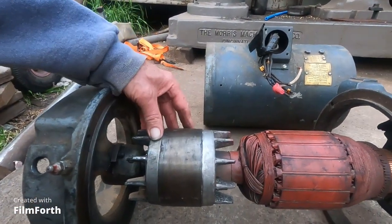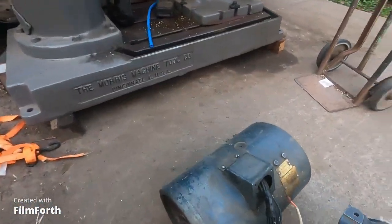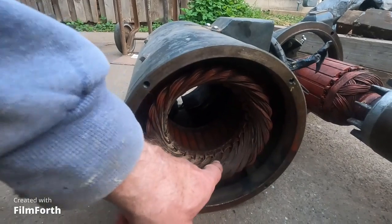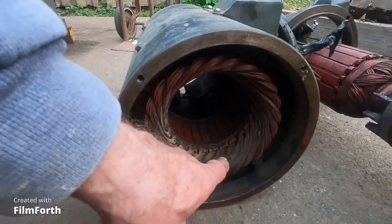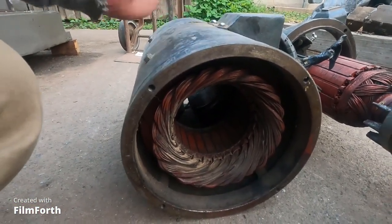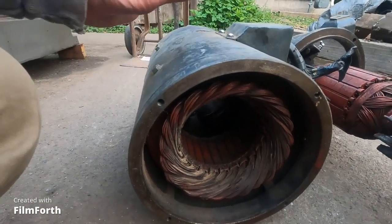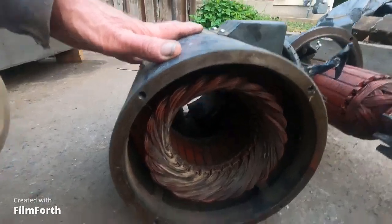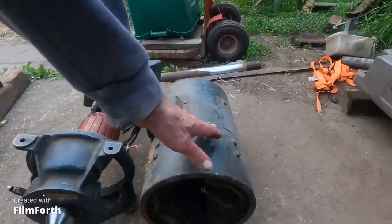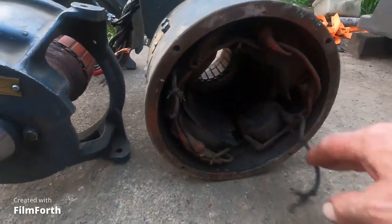Let's have a look at the central part. Here's the AC end, and here's what smoked — you can see it cooked the windings out. This thing was really putting out some smoke. I guess it was single-phasing or something, just age and everything. It was sitting there buzzing because the static phase converter burned out and then I flipped the breaker.